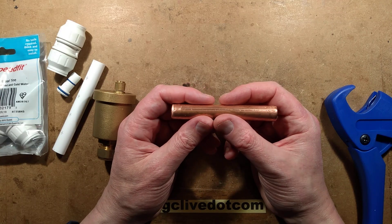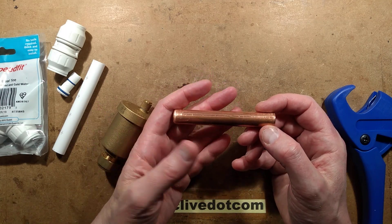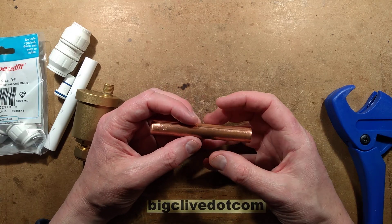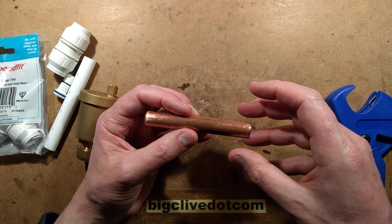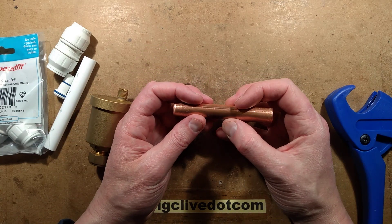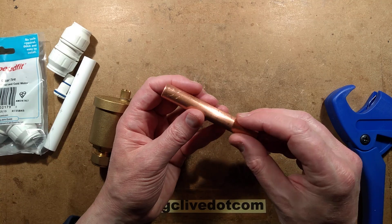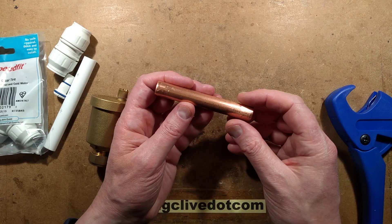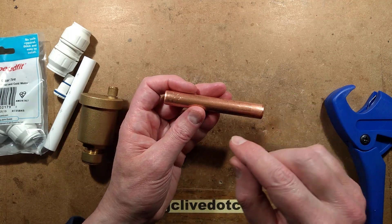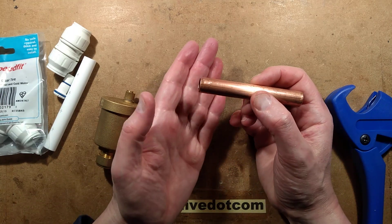My faith in copper was shattered here when I discovered that the pipework in this building, which is quite old, has impurities. People gave various reasons — it might be because of a failed galvanic electrode in the water heater, but there's no system like that here. It was the main cold water line coming into the building, and there's a possibility it was flux contamination. The gist is I discovered one of the pipes was leaking — a tiny pinhole appeared — and when I opened a section of pipe up I saw lots of little corrosion pits all over the inside.